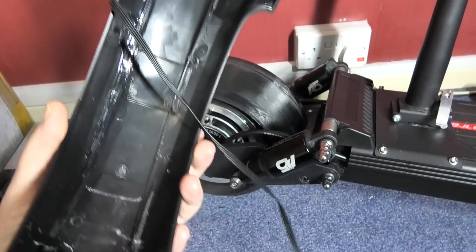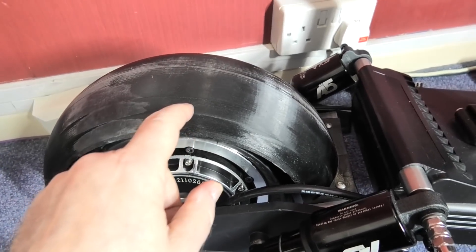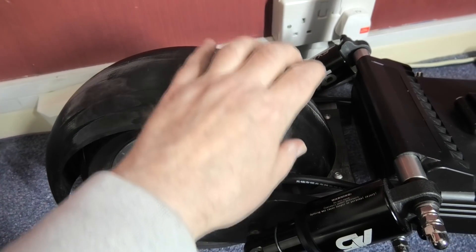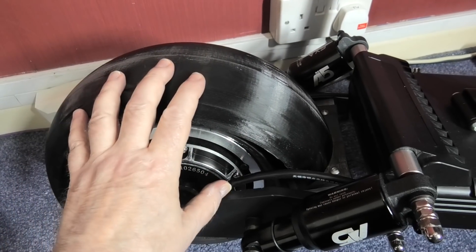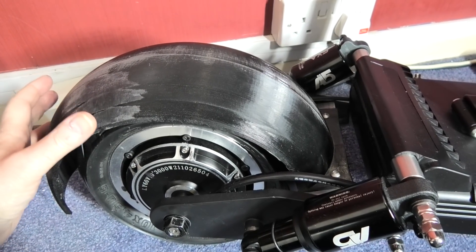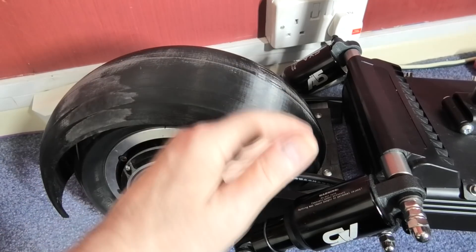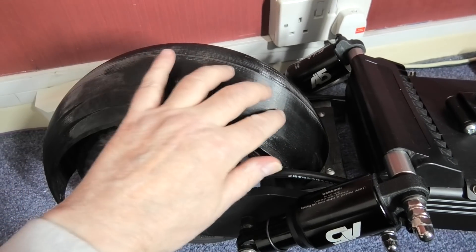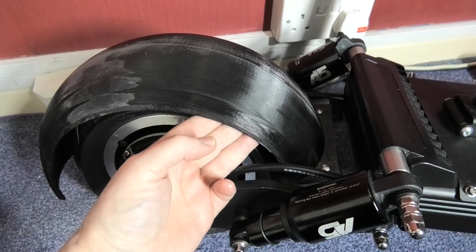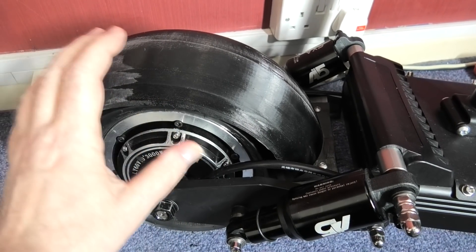Here's the original one — I could just put this on, it's not a problem, but I want to make my own carbon fiber ones. What you've got to bear in mind is this is the pattern — not the mold. What I have to do is get the material and lay it over the top, and after that's done I can remove this and then I'm left with the mold. I can then lay material on the inside. So this outer piece becomes the inner dimension. It's about four mil thick so it will raise it four mil.